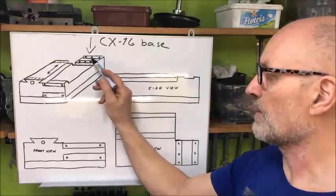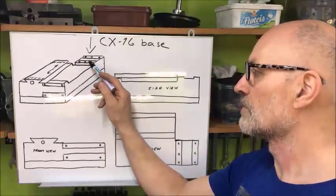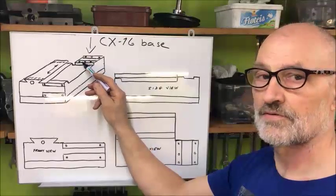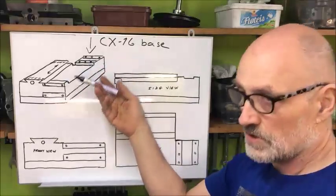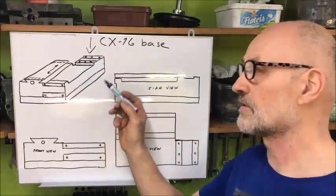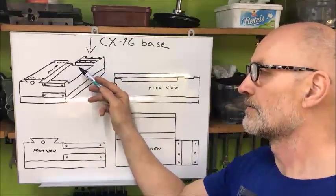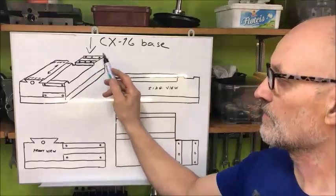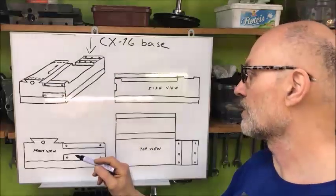These weren't that bad, really, but from a geometric point of view — alignment — they were not really meeting the standards for a static fit, so they needed scraping too. Which of course means I have to take the bottom part of the column as well. But now they are co-planar, and I'm good with the sort of alignment.